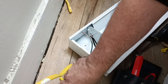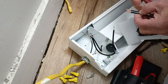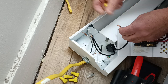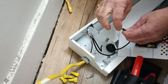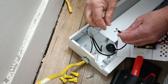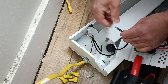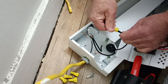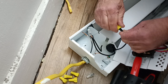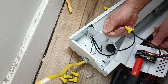Use yellow wire caps. Hook our wires — it doesn't matter which one — so we'll get our strands here. Since they're not pre-tinned or anything, I'll twist them together a little bit like that. Get our wire nut on, get it nice and tight, and make sure the insulation is down inside the wire nut.